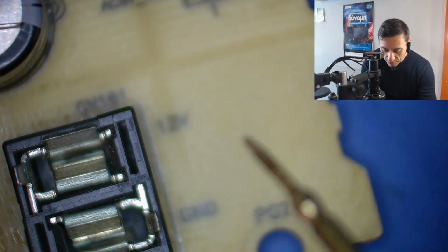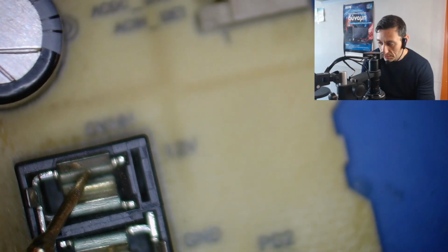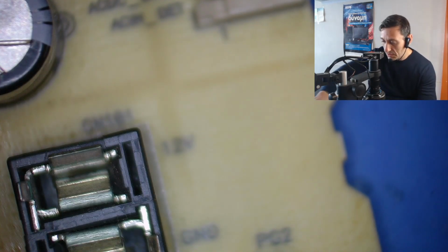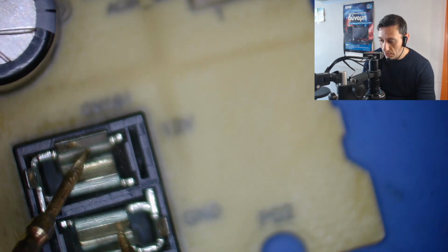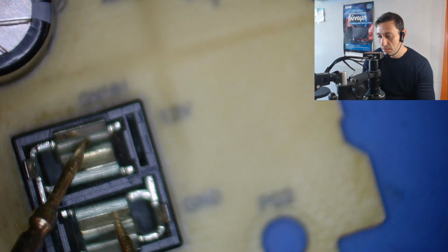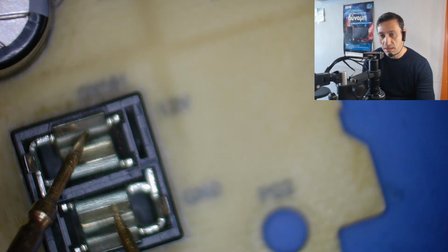What about the output? It is these metal probes here. Voltage drop 0. No, not with diode mode. Let's measure in ohms mode. On the output we have 5.4 megaohms. The third point is dropping, 2.8 megaohms, so it's okay.